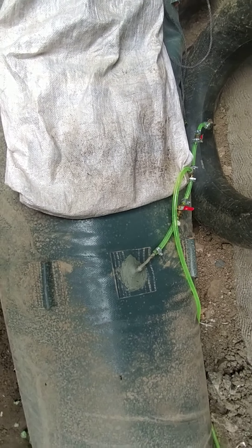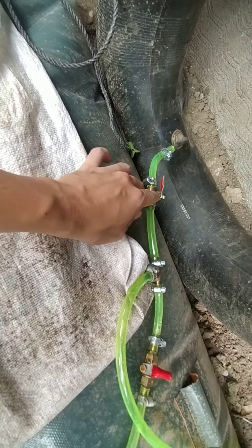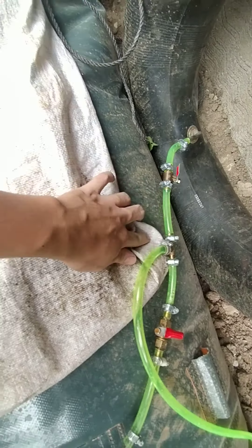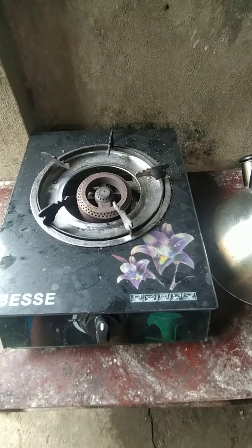I need to replace this tire tube. So this tire tube is optional — this will store the excess gas. I need to store excess gas because the system as small as this cannot sustain your daily cooking yet. So you need to store the gas first before using it, and you need to put a control valve here as well if you need to disconnect this and replace it with other storage.